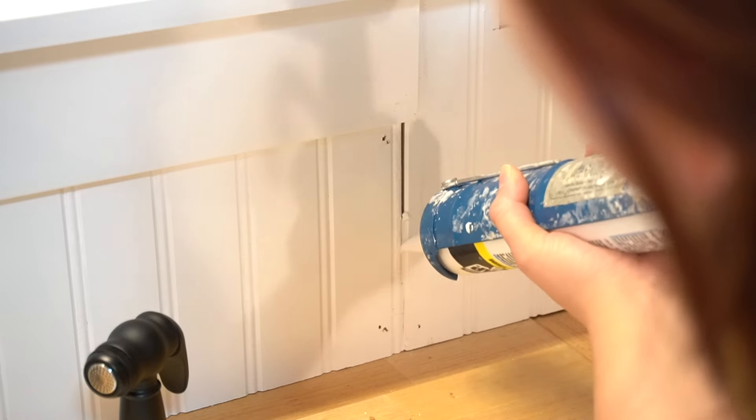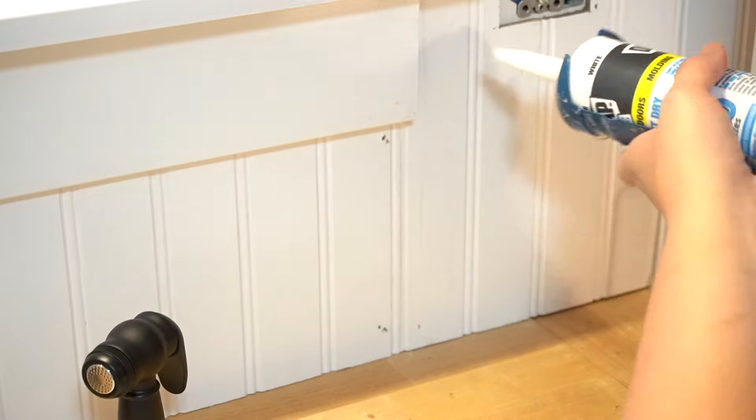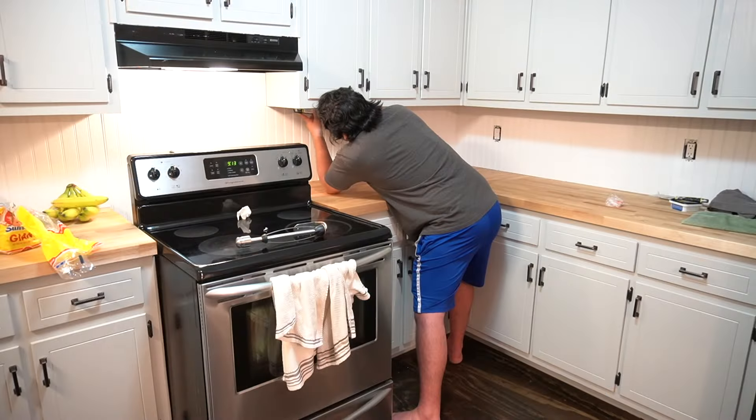It was off to making all of those seams disappear, and I used caulk for this — paintable waterproof caulk that you would use in a bathroom or kitchen area. You just fill in all those crevices and wipe your finger on it to smooth it all out. I like to use gloves for this. The Latino Engineer did all of the caulking above where it connected to the cabinets underneath. You'll also need to caulk the bottom section of the beadboard where it connects to your countertop, and you need to add blue painter's tape for this. You can see the butcher block countertop through those little ridges in the beadboard, but after you apply your caulk — a small bead and then run your finger across — when you remove your painter's tape, you will no longer see the butcher block through those ridges. It should be one continuous straight line, and you do want to remove that painter's tape before the caulk dries.